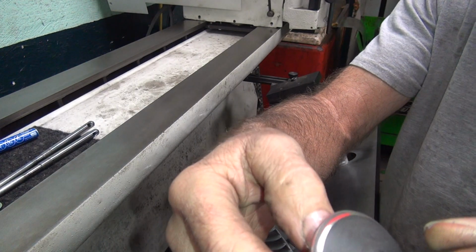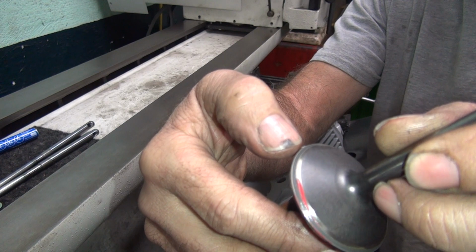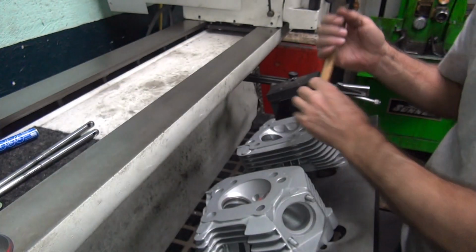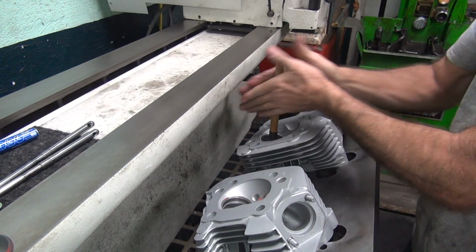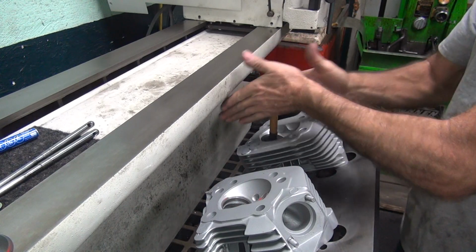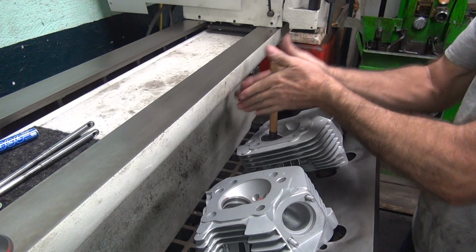Okay, seat's on the valve now. You can see the little edge right above right there. Whoop. You can see I'm pretty conservative. I could have been out a little bit further on the edge, but that's all right. I've lived enough times already. At least we know we're on the valve face now. We were off it before, like half on, half off. That works all right for racing, but not street work.